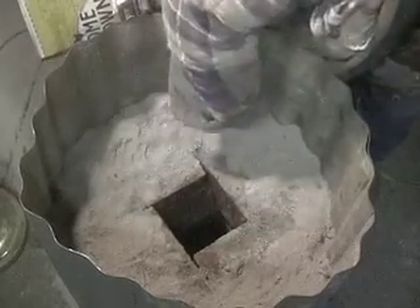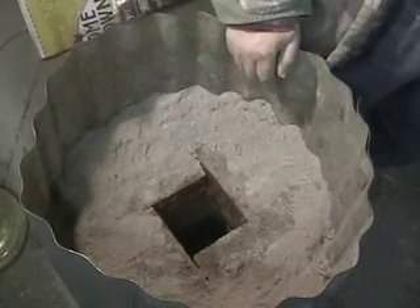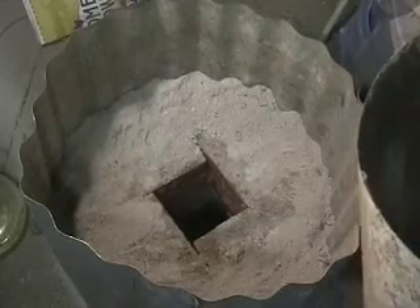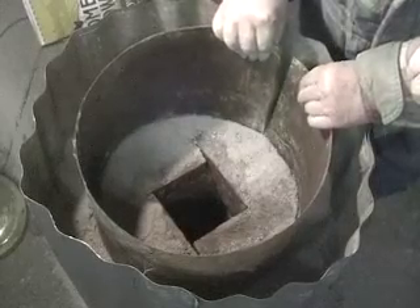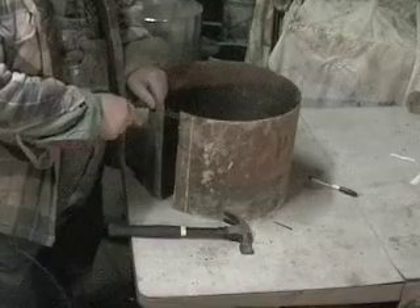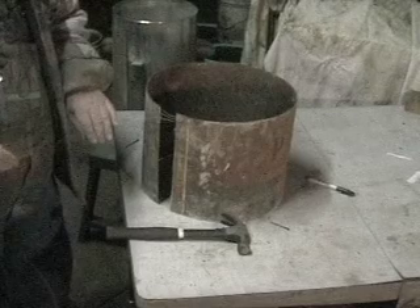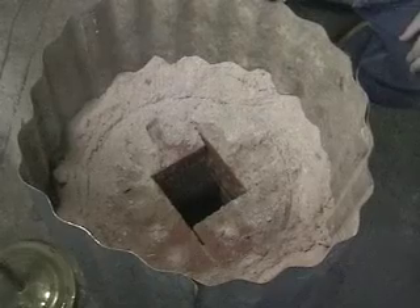There's basically a bucket stove chimney. The bricks are insulated with ash, and the next thing we're going to do is put on some pot supports and a skirt — we can probably put the skirt on first. The skirt's going to go in here like this and be adjusted to the side. It doesn't quite fit perfectly, so we're probably going to have to add a piece of sheet metal here. In the meantime, we can put some wires across here for the adjustment. The inner pot skirt is made from a 15-gallon drum that was cut with a hacksaw, cut between the ribs — it'll make a nice pot skirt. We've got the ashes put in around the bricks and adjusted the corrugations to be more or less circular. Now we're going to put in an insulated skirt.